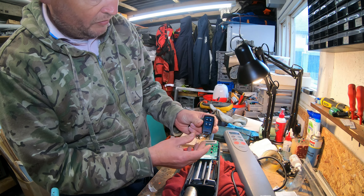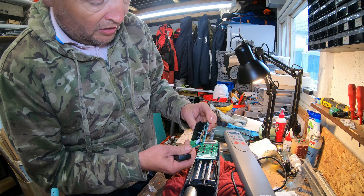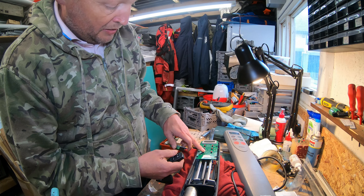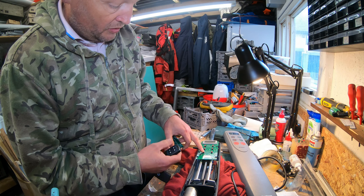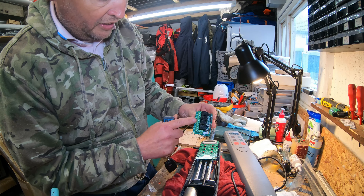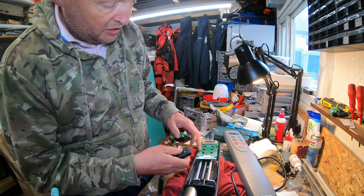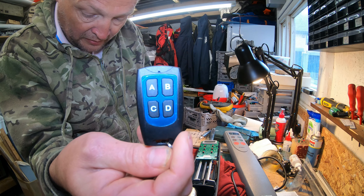It's an easy mod. Basically those switches are going to mimic what's on there. It's an easy little PCB available from China — I'll put some links up. It works in the same way as a normal switch. These are push-to-make switches, so every time you press one of these buttons it pushes on the switch. This PCB will do the same thing — I'm going to be fitting the PCB in, wiring it in, and wiring it directly to the switches.